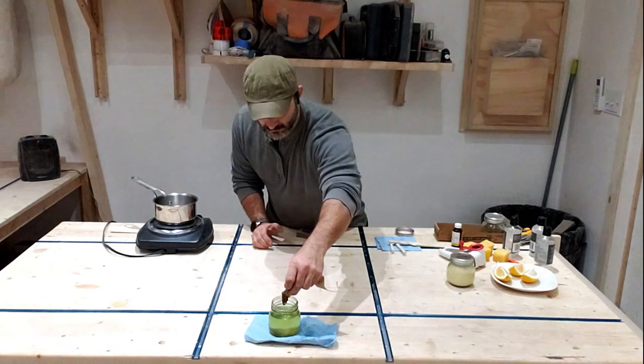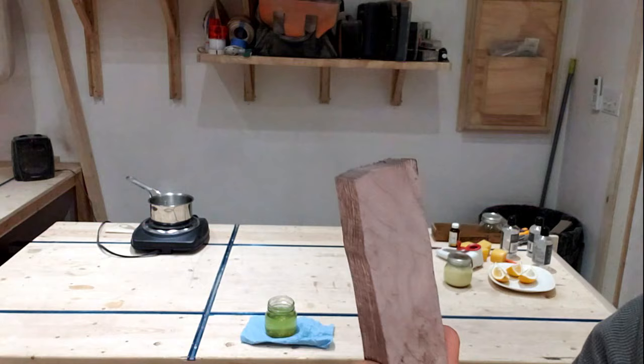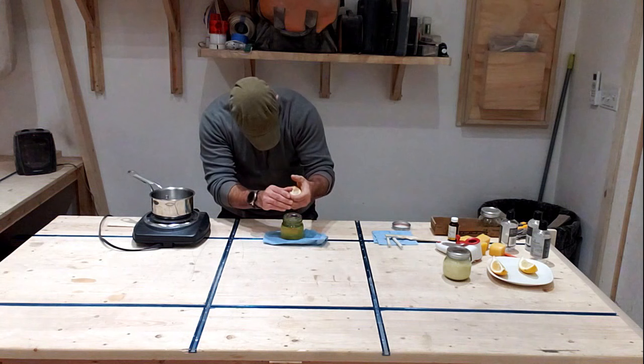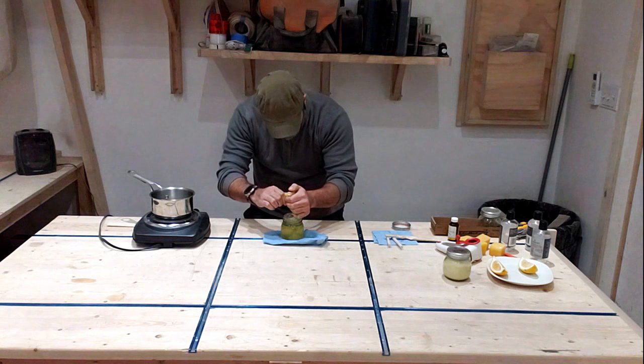Just a quick test to see if I'd get that nice waxy solid coating for the protection the wood needed, but also get that nice polish that would really bring up the grain pattern and show some really beautiful grain in the wood. So far it was looking really good — I was really happy with that. So I decided to add the lemon, and again since there was going to be much more oil in it, I needed to make sure the lemon and the oil were going to mix. Since it was heated up it did mix pretty easily and I was able to get a consistent amount of lemon through the entire mixture.